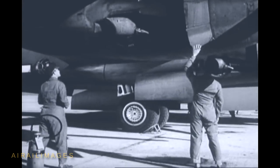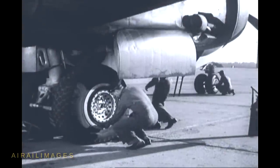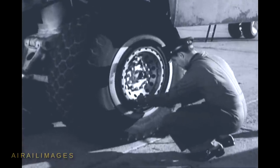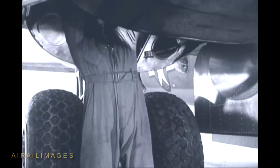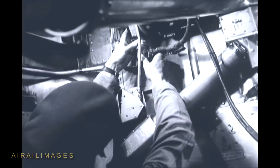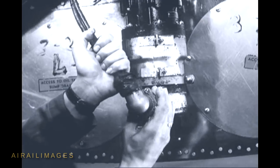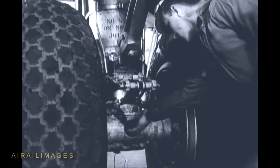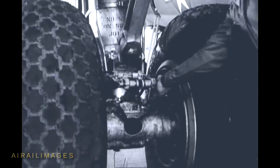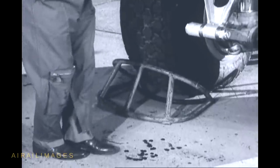Now you can look over the engine cowlings on your way to the other main landing wheel. This gets the same inspection you've already given its mate. The co-pilot ducks into the wheel well to inspect the equipment there while you work on the wheels. Measure tire pressures again — on these tires, the pressure should be between 75 and 85 pounds per square inch. Inside the wheel well, the co-pilot examines the wires, connections and switches, making sure all the cannon plugs are on tight, paying particular attention to the plugs on the motor which opens and closes the nacelle doors, and also the plugs of the normal and emergency landing gear motors. He then examines the strut and inspects the brake lines, making sure the hose is not chafing and no fluid is leaking. Clearance between pin centers: 13 and one quarter inches — right. Now check that the wheel chocks are in place: one behind the inboard tire and one in front of the outboard tire.